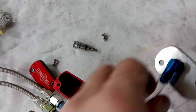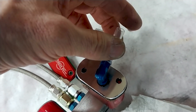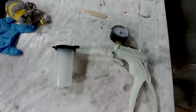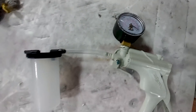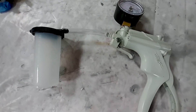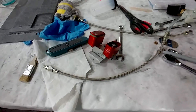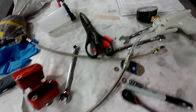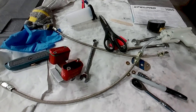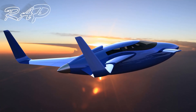There's that little cover Devin made for the brake reservoirs — it goes over the reservoirs and you pull a vacuum to draw fluid all the way from the brake caliper through all the cylinders up to the reservoir. They'll use a little vacuum pump with a small reservoir on the end so no fluid gets into it. By the end of the day I started testing some of the lines to make sure they were holding good vacuum before pulling any fluid through, and I found a few problems that we'll have to fix tomorrow.